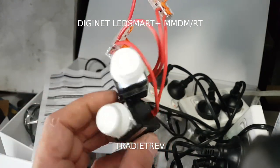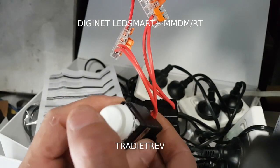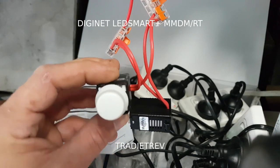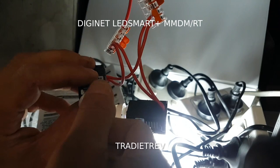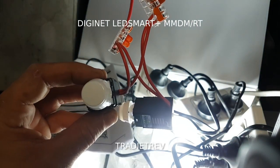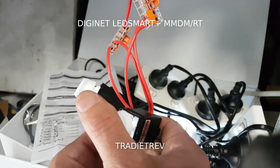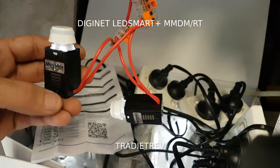Check they're all flashing - especially important if you've got a three-way. Now set memory mode: seven times - one, two, three, four, five, six, seven. It would light up if it was on. Clockwise to turn on, anti-clockwise to turn off. Turn it on then click the button to confirm, and they should both operate at either end. Turn them down and turn it off.